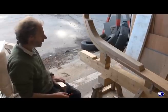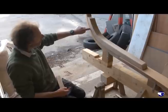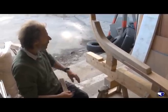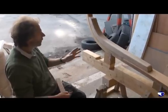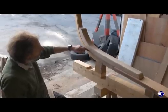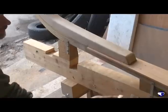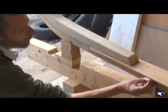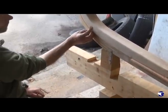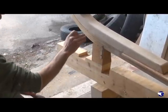When we come to fit the planking, we've got the V groove that we routed into our stem, which is not completely accurate, but it's 3/4 of the job done. We need to chisel away quite a bit more of the knee or the deadwood here. So we've got our plank that sits about that angle back here, and by the time it runs up to the stem, our garboard plank is almost vertical. So that's quite a change of angle, both for the plank and for this rebate groove.